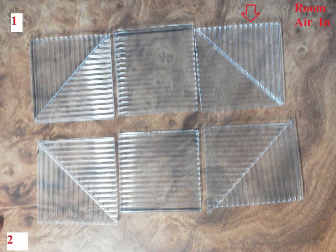We start with the stale room air entering in. The two 45s make a 90-degree turn and the air travels down the length of the unit. This middle section we can expand as big as we want, to have more surface area exchanging heat. Once it reaches the outside, the two 45s again form a 90-degree turn where it then exits. So the stale room air has gone out to the outside.